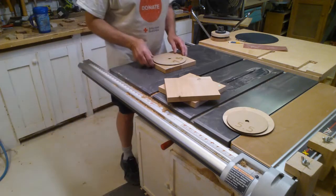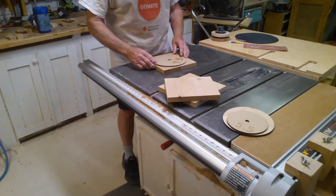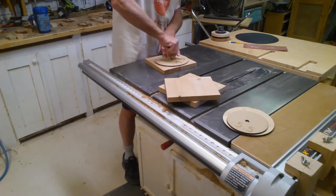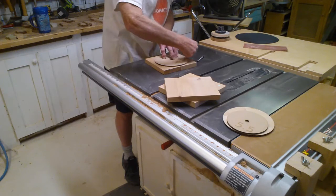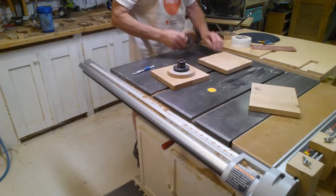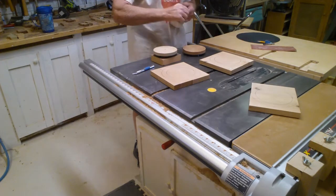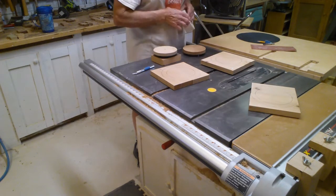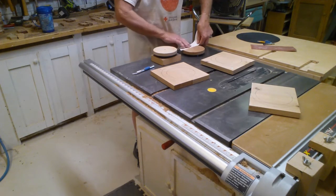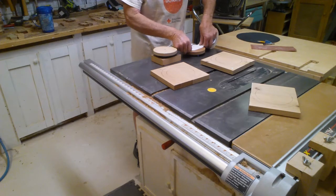Now what I have to do is work on those boards I glued up — this is my base. There's my famous circle jig — I love my circles. I've got a spot in the middle to mark my center. That's 7.5 inches for the outside; I also have to mark it at 5.5 inches — that's the size of my face plate. I put a little mark in the middle for the center. Once I do my inside I can put my face plate on the mark.